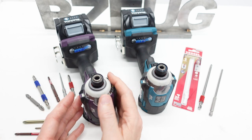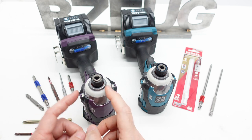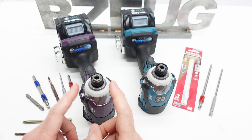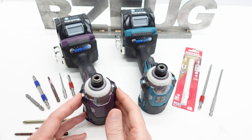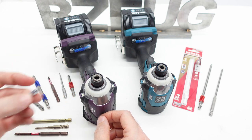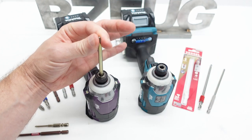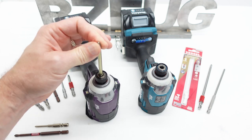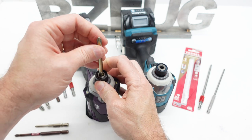Someday after I've collected more of these — there is a newer version I'm very curious about in the olive color — and I'm waiting for Makita to come out with their 40-volt max with the hydraulic impact. Maybe after I collect more JDM examples of Makita impacts, I might be willing to convert one over to E6 compatible by putting a spacer down in there. If you take an E6 bit and put it in a Japanese chuck, it fits and it locks, but downward pressure pushes it past the detent against that flat surface, so there is some risk of it jamming — I just haven't experienced that because I don't use E6 bits in my JDM Makita.